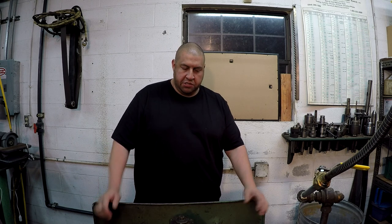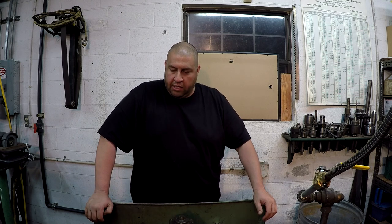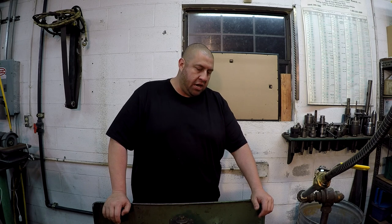Again, I wanted to emphasize the use of a taper attachment and try to give you a general overview. I don't intend this to be an all-in-one video on everything about tapers and how to figure tapers and how to set up for tapers, but we are going to set up for this taper here, and I'm going to show you a technique that you can use to make sure that you are traveling the proper distance on your cross slide, you know, your taper per foot.